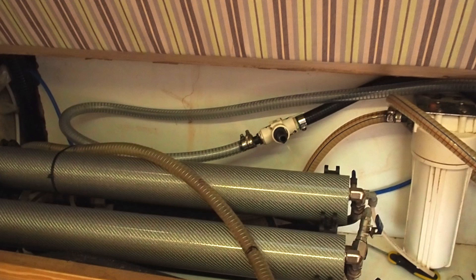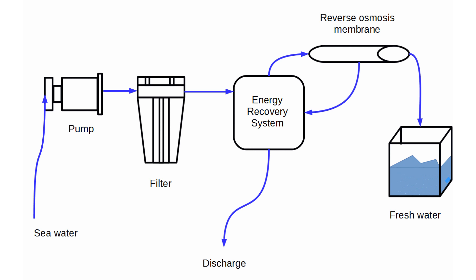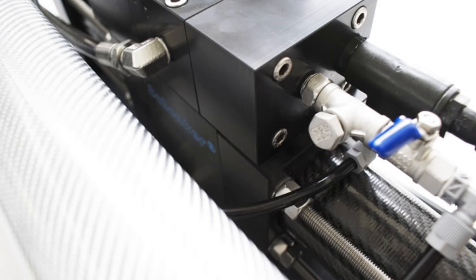So how is a Schenker watermaker different to a normal watermaker? You need high pressure — 55 bar or 800 psi — and normally that requires a high pressure pump. But the Schenker has an energy recovery system: it takes water pressure to around five bar, puts it through a five micron filter, then through the energy recovery system, which increases pressure hydraulically by about ten times. So we only need a low pressure pump, which means much less power.